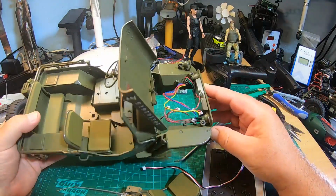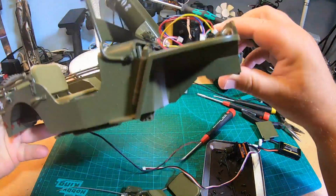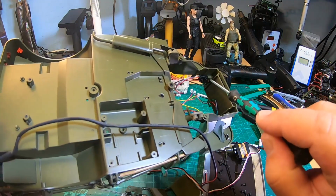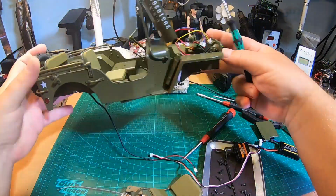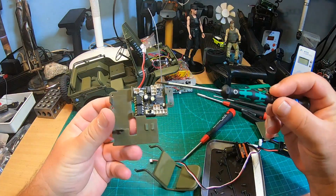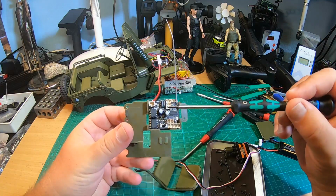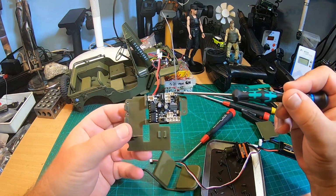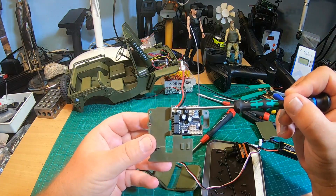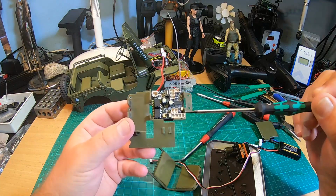Super nicely made, not a lot of difference to the big one. Here you see the LED housings for the main beams. And those hazard blinking lights also have special housings, so that's really quite awesome. And the board, which is ESC, receiver and light controller, that's quite awesome. Here you see the huge MOSFETs for the huge motor, the ESC, and you will find three 3-pin housings for the 3 servos, one 2mm JST PH housing for the large motor, and 1, 2, 3, 4, 5, 6, 7